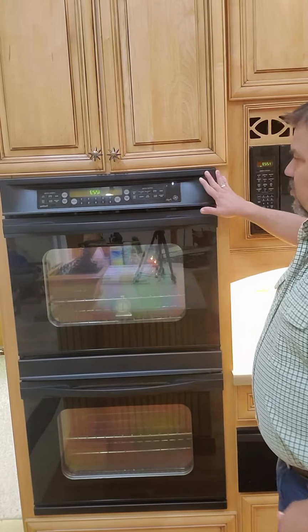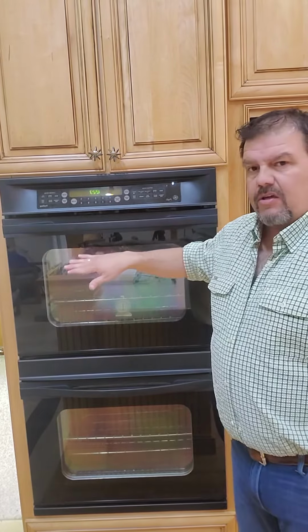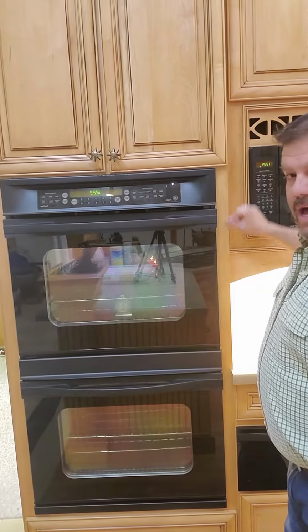If you're dealing with a frameless cabinet, you want to make sure you have the right size. This face frame would not be there. It would be frameless, but you still have a 3/4 inch piece of the box going down. So you have to accommodate for that. Same thing, if you have a 30-inch opening or a 30-inch appliance, you want to have a step up of a 33-inch cabinet.